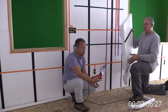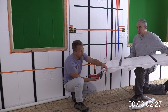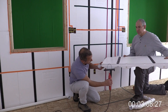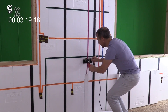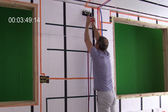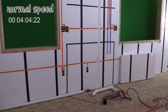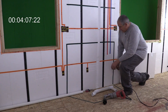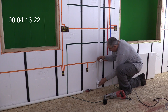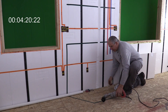We're going to use a special tool called a hot knife. We determined this is the two-inch coupler we want to cut through, so the blade has been set — it's a wire blade — and we cut out this section of foam. The pipe has been cut out to fit in the wall already. Now we just need to drill a hole down through the shipping container floor, the subfloor, and the Insofast, using a hole saw.